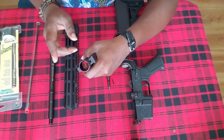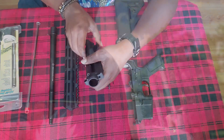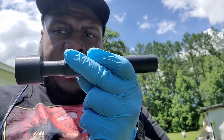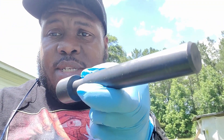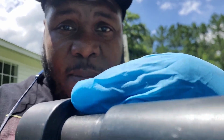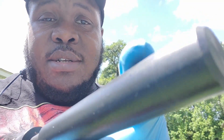So we're going to go outside, put this in the vise, and get to it. Now in the Wheeler kit you get the lapping bar. When you're putting the lapping compound on, you're only supposed to put it on this inside surface right here — that is the only area that gets the lapping compound. The actual pilot of it, when that goes into the upper receiver, you want to oil that to reduce friction because it's going to be spinning inside the upper receiver.